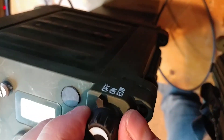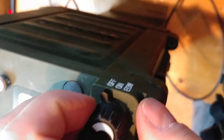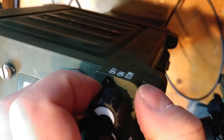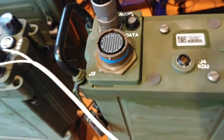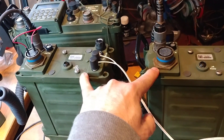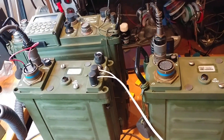There's a switch here with options of off, on, or EOW — Engineering Order Wire. Engineering Order Wire is essentially an intercom between the radio operator located with the radio, at the LCU or local control unit, and the person on the other end using the RCU or remote control unit. These units are interchangeable — they only get a different designation depending on which one is with the radio and which is remote.